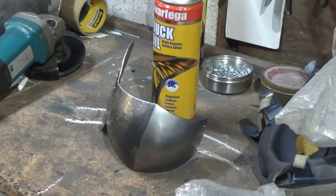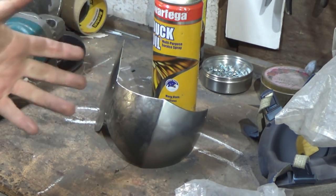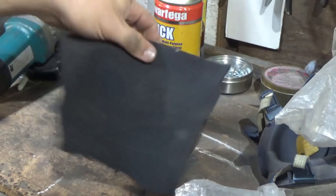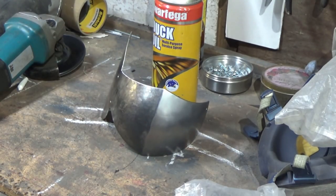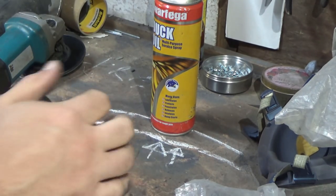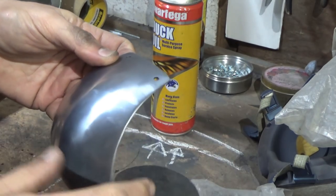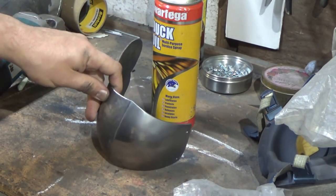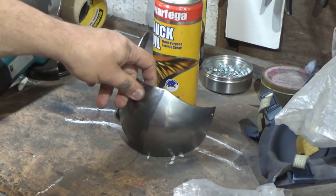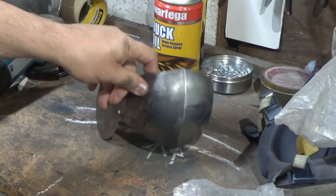The simplest way to keep it clean is to use self-cut linen bags or cotton pillowcases - store your armor inside those and polish with that bag. Gradually the bag goes oily and you have a nice oiled cloth sitting across your armor all the time. If you're going to paint the inside of the armor, I'd recommend painting it after the first 80 grit stage, because when paint leaks through holes a quick second pass with the 80 will lift that for you without leaving paint streaks. If you're not painting, just crack on. Good luck and happy armoring.